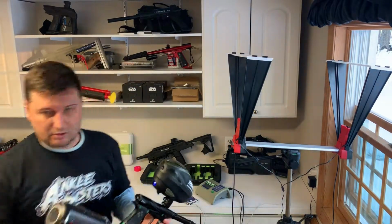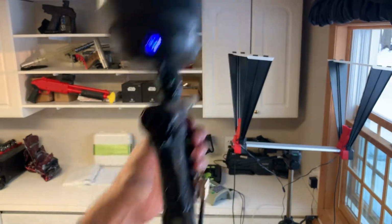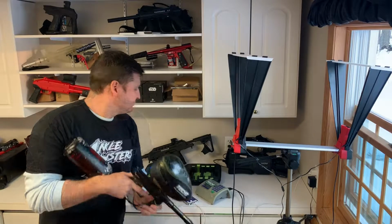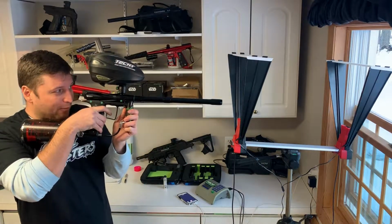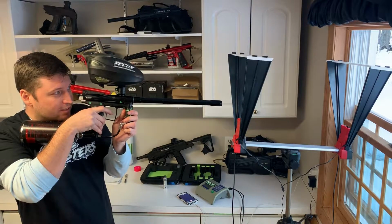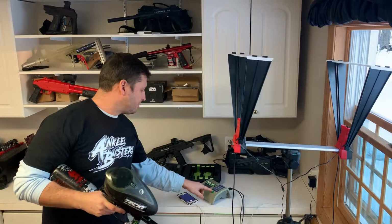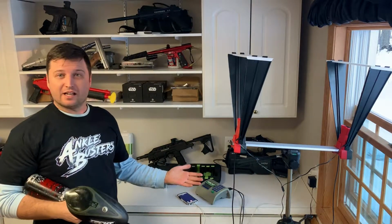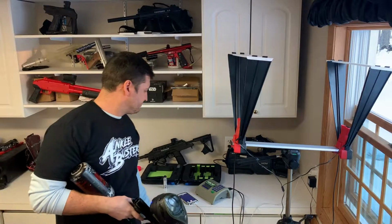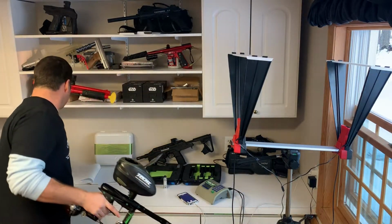All right, so dwell 8.5. Here we go, 8.5 dwell. Yeah, and there it is. I don't know though, that third shot came out pretty good. 285. Let's give it 30 seconds and see if that first shot drop off is still there. While we're waiting, we'll add a little paint.